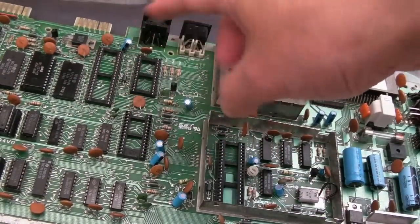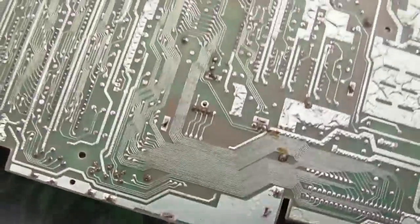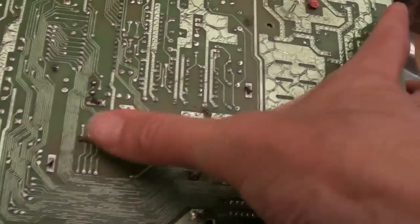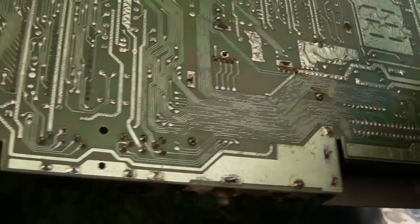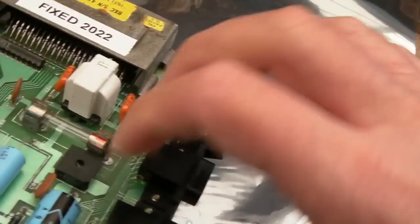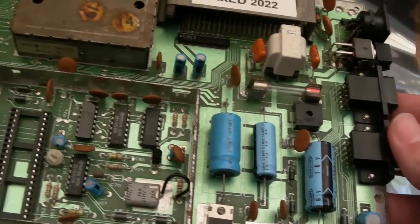Yes, it's got a number of single wipe sockets that came from C64 motherboards, but it's been rock solid stable, connectivity wise fine, and you can see the solder points on the other side there. You can barely tell it's even been worked on. There's barely a mark on it. There's a little bit of flux there, but I cleaned off the flux around there. And yeah, power switch didn't come out too bad. And we got a good join there. And the board is pretty pristine.